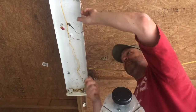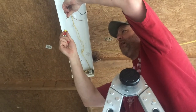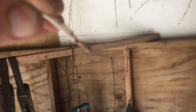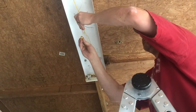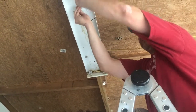I'm going to start with the neutral. Just make sure that the wiring is good before you put it back together - look for any cracks, breaks, or weak points in the wire. For fluorescent fixtures, just make sure that the little wire overhangs the big wire just a little bit when you get ready to turn on the wire nut, and just do it till it's snug. Don't try and twist it to death - you're not making any better connection by over-tightening it.